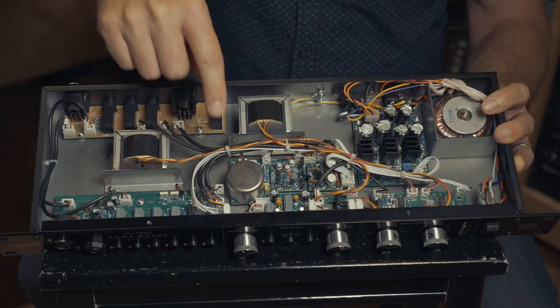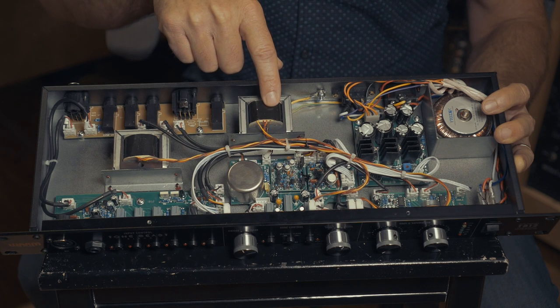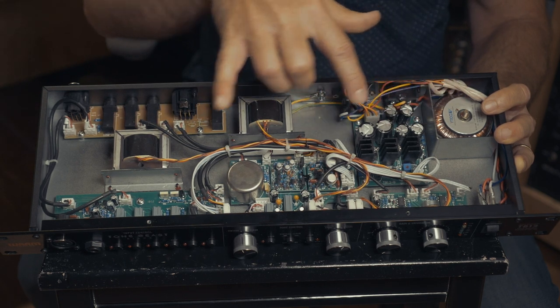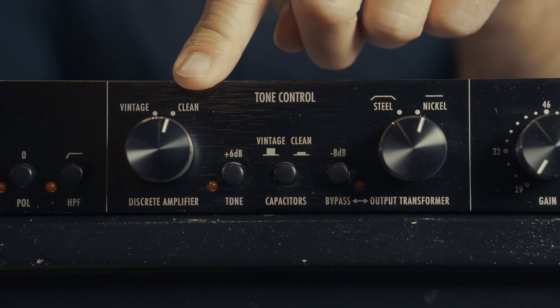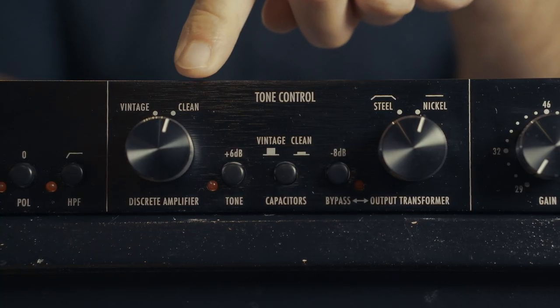The name that comes up routinely throughout microphone preamplifiers that I really enjoy using is Class A Discrete. Our signal hits an input transformer, which hits a discrete op amp, and then an output transformer — that's it. The audio path itself is very clean and very pure. Most everything else in here is power supply, metering, and switching related. This is a beautifully laid out box. Next we move to the knob where we choose between two different discrete amplifiers. When it's set to clean, we're hitting a 918 Jensen op amp — that's a circuit from the early 80s, and it is a colorful but cleaner of the two options.